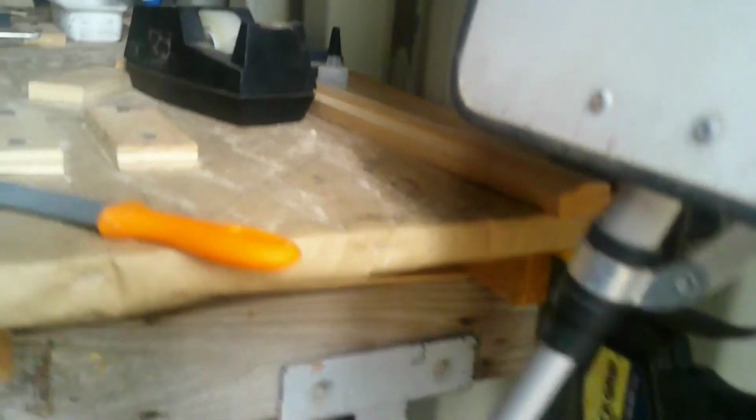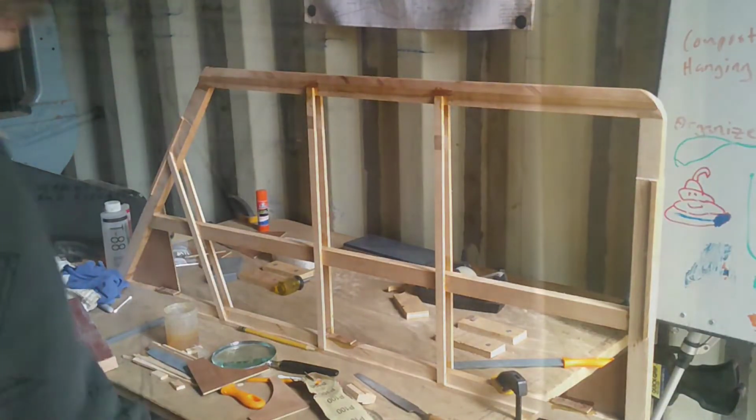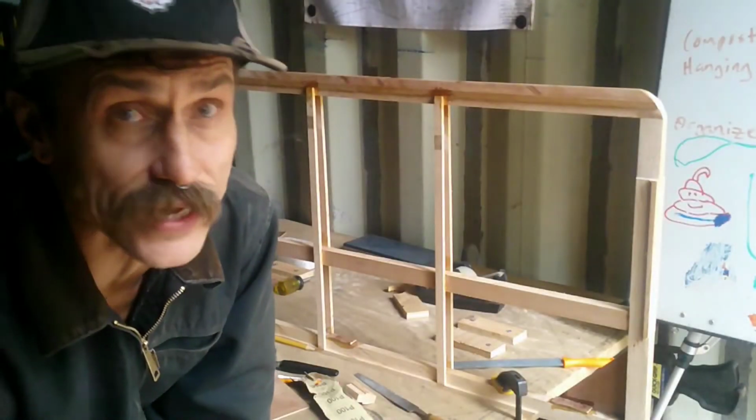And then I put it on top of some sawhorses, and using a level and some shims, I then shimmed all the parts until the table was perfectly flat in all directions. Once I was done with that, I covered the table in paper and translated the plans to the paper full size so that I was able to build a jig on this table and jig this elevator into place. Especially being that I get to make two of these elevator pieces, this is going to be especially helpful when we build that next elevator.